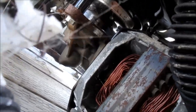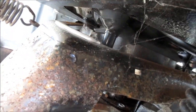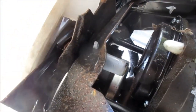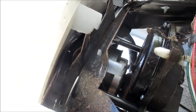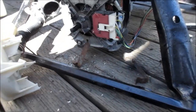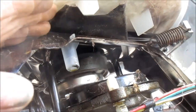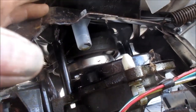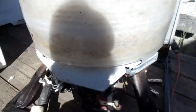This one also has another problem. You see those little white things right on top of that black thing? Those are the shoes. Sometimes those shoes will wear out and cause it to spin very erratic. Now this is not supposed to be there — this tripod thing has another piece of metal that's not square. These shoes should be flat and this piece shouldn't be sticking right there. This usually occurs when you lay the machine down and run it around off-road kind of, and this metal sliding piece comes loose. It doesn't sit square, so you have to readjust it.